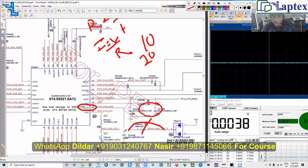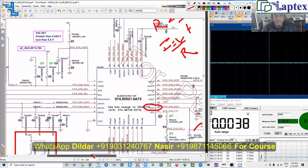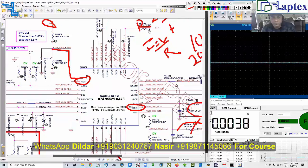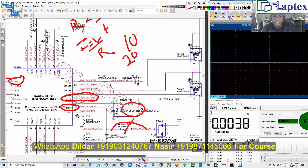This is the first area to check. The second thing to check is that AC-in must be proportional — whatever voltage comes through the adapter, through this resistor divider, comes into the AC-in pin. You have to check this AC-in or AC detect signal. Then you will get the VDDP voltage — 5 to 6 volts — depending on the charging IC architecture. In some architectures you get 6V, in others 5.4V or 5.5V.